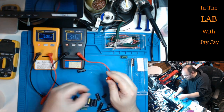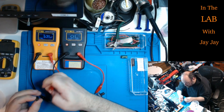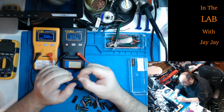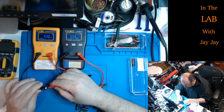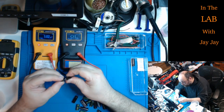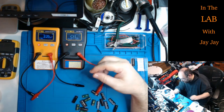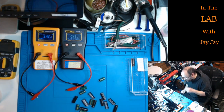Okay. And we've got a couple of these clock capacitors to clock through. So we'll just do them one at a time. Oh no, that one's lost its lead, so that saves us a bit of time. And this guy, it's hard to get the polarity on these. I'm not sure, it's not clear. Alright, yeah, it's pretty much registering nothing. ESR meter says open circuit. Okay, well, we haven't had any of those read correctly. Well, I wasn't really expecting much. That one's shot as well. Alright, so that does all of our clock capacitors.